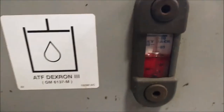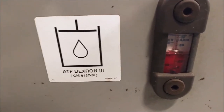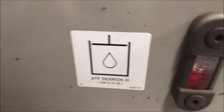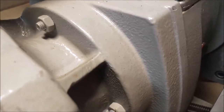That's not the only way to check the oil in a gearbox. Sometimes you physically just put your little finger inside the fill hole, and if you can feel it, well then you've got enough oil in there — sort of a rule of thumb. Here we are over on the other side of the gearbox. You can see there's a little plug there, but there is no sight glass, so there's no way externally to see how much fluid is in there. There's also no refill cap — this plug might be a drain plug, I'm not really sure. There's no fill cap for me to put a finger in or open up and look in there.